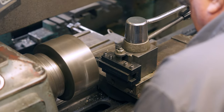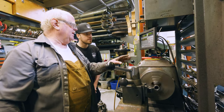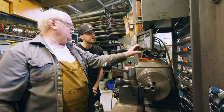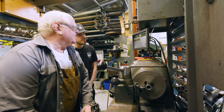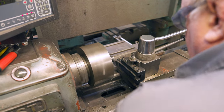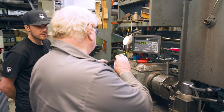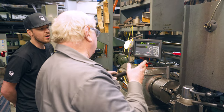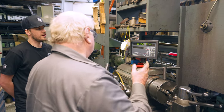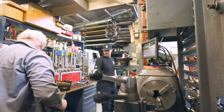We just got a bit of fuzz. We take that and set it on zero — that's the Z axis. Z, we go to zero and back that off; that's probably a couple of thou, so we're going to go about six. Do you do that by eye or does this tell you exactly how much you've moved it? You touch it so it's just touching the end of the tube, zero it there, then move it 16 thou. I did 15 because if you can see it, it means you're cutting. So that's the tubes done.